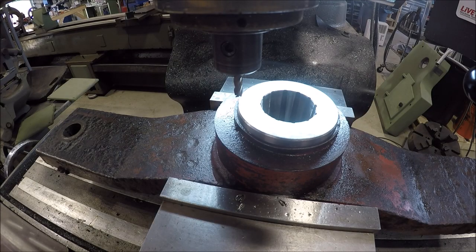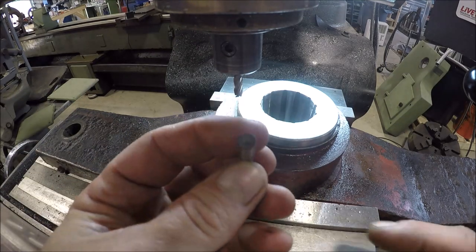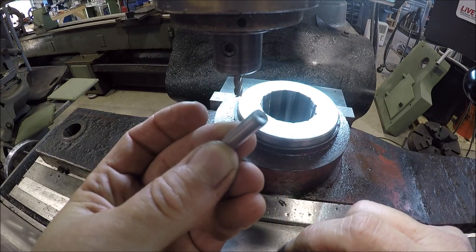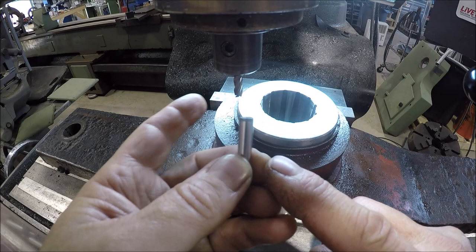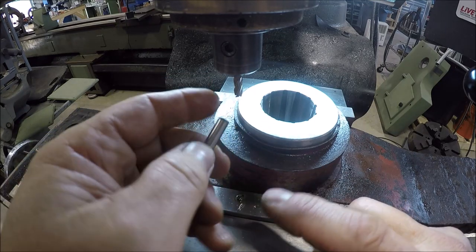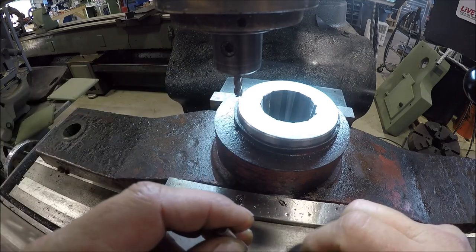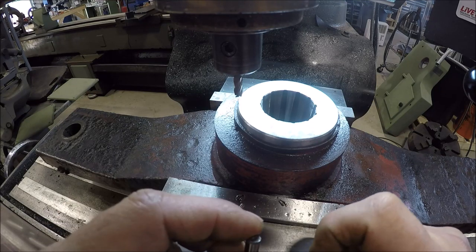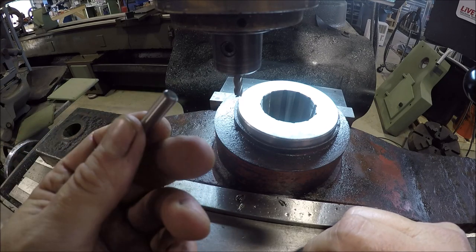Have everything set up in the mill to go ahead and cut a couple keys. So I've got 1 inch long quarter inch diameter dowel pins, except they're measuring 249. So I've got a quarter inch 4 flute end mill now. I'm just gonna run her down till I've got a nice flat spot, and then we'll drill it out undersized. I do have a 249 reamer, but I don't have a 248, so we'll see how this ends up fitting,